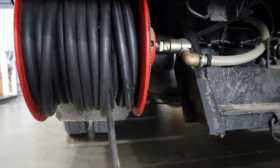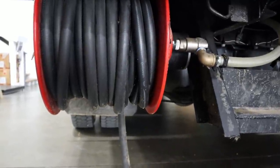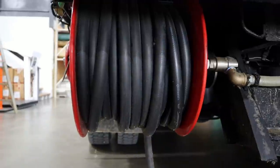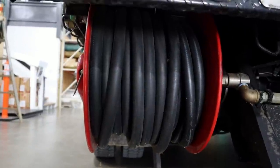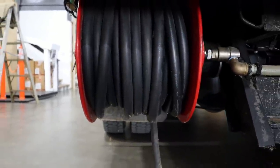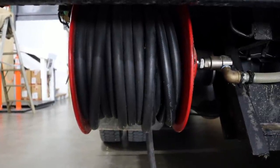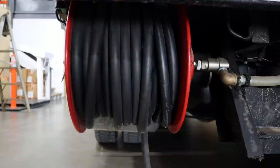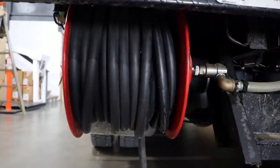Here's where the reinforced tubing comes out from underneath the truck and hooks into the swivel on the reel. Everything's one inch, as few fittings as possible. I even went with a one inch reel meant for one inch hose. Almost every other reel I ran across that was meant for water hose had a very small orifice going through the swivel — some were even down to three eighths inch, which really causes a lot of restriction.